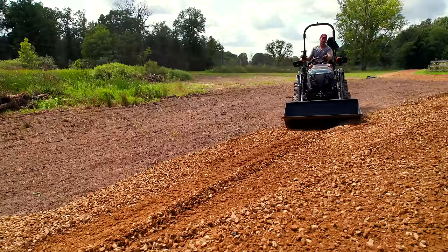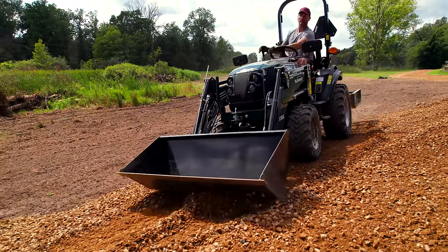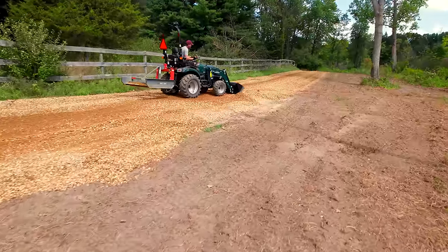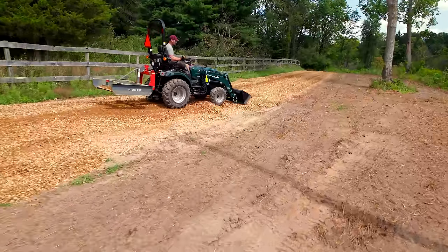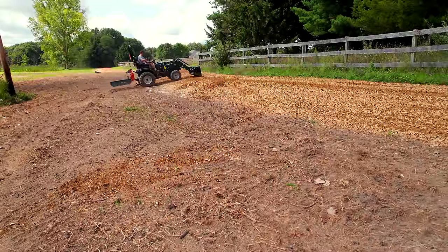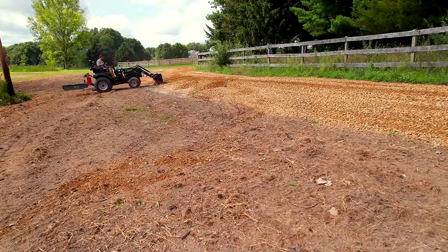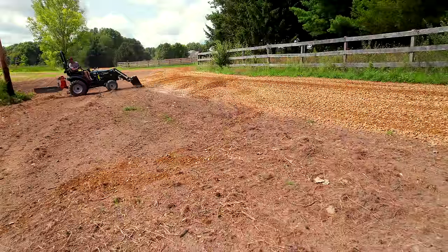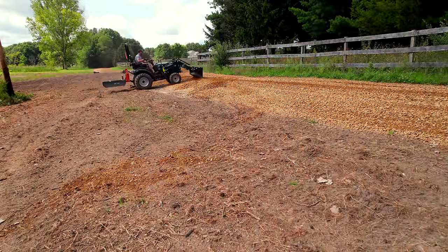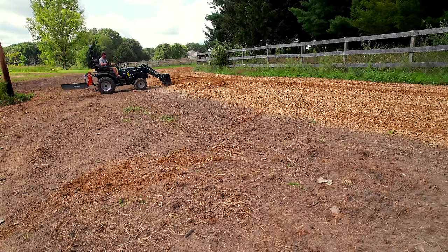And that means that in some areas, I can still see some of the tarp, and we've just got a base layer on there, but I probably have to add another 4 or 5 inches in some of these areas. Towards the middle, it's definitely been packed down, driven over. That's the nice thing with these dump trucks: if you have it relatively smooth and tailgated like that, every load, that big heavy truck can drive over it back and forth and really help to pack down at least the tire track lines, right? Maybe not the middle or anything else, but they can get you a big jump start on that too.